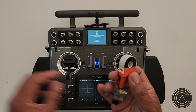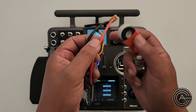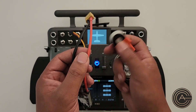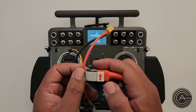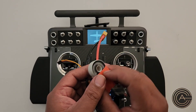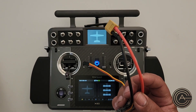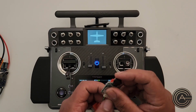There's a little hole on your ESC — you want to go ahead and connect it. You'll have to desolder, run this through that hole onto the red wire of your ESC. The only thing is you do have to look at the arrow, and that arrow should point towards your ESC. Once you have that, solder it back together, and the only other thing you have to do is hook up the S-port.